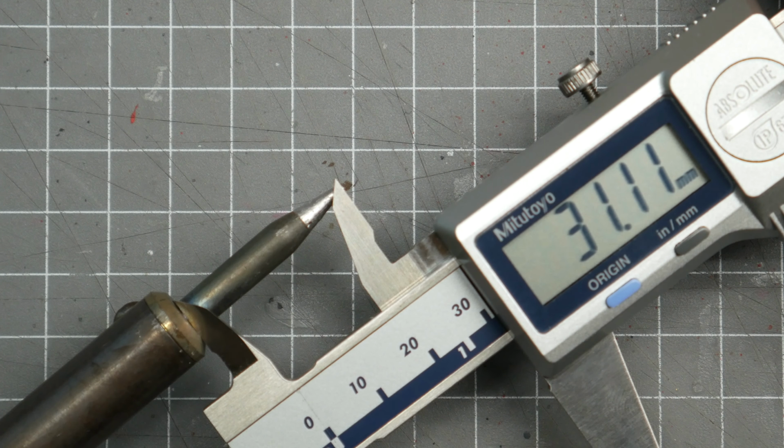The annoying quirk is its power button. It's not actually a physical button, but a capacitive touch sensor switch button thing. Why is this button annoying? Simple. It doesn't always work. You can be tapping or pressing it and it won't register at all, which means it doesn't power on. Normally unplugging and plugging it back in fixes it for a while. BigClive.com modified his iron to bypass the button, but that means it'll be on all the time. This could be an issue if you run it off a battery or power bank.